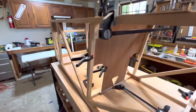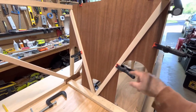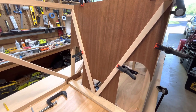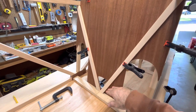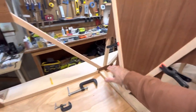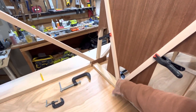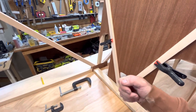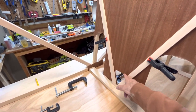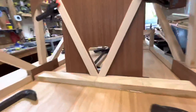Currently today what I'm about to do — I cut out this piece here for the front pilot's seat back, and I cut these openings for the pilot's legs to come through. I cut these pieces here that meet down in the middle, and this structure for the front pilot's seat will be built right here. I used just a router and then a small Dremel sanding disc to cut this opening here for the plans.